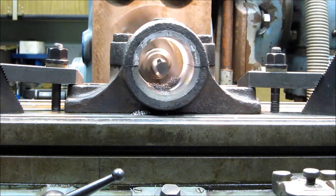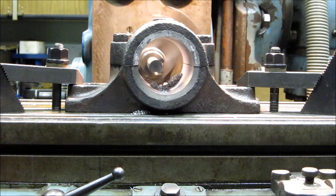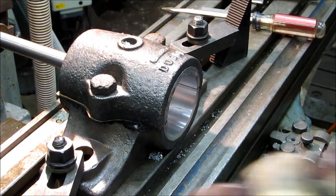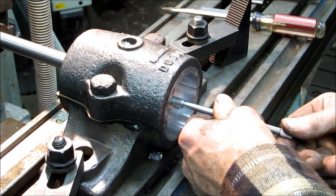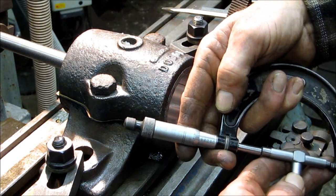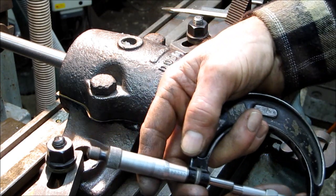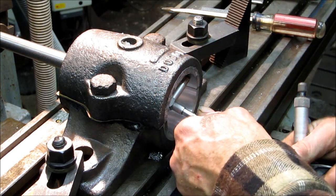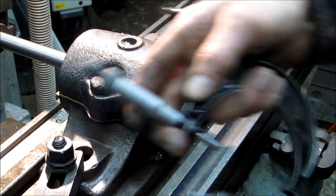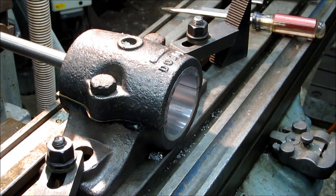I'm going to do this bore, check it, and then we just got the grease grooves to do — pump the hole down through there, just deburr the edge. I'm going to slap some primer on it for them and it will be all done. One and a half over the nominal dimension — one and a half over — I'm very pleased with that bore. We get a grease groove in there and clear out this passage for the zerk and we've accomplished the bearing.